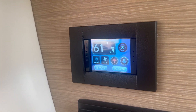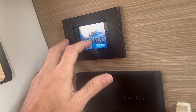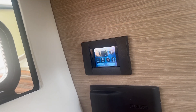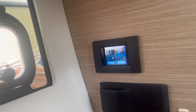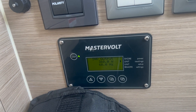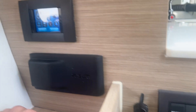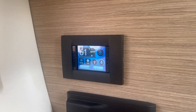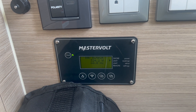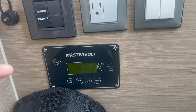Set for 50 degrees, it's 62 degrees in here. Going back to auto speed and bringing the set temperature up to where I want to be — I'm going to say 61 degrees in the boat. It's already 61 in here so I'm looking to maintain 61. It takes a little time for the compressor logic to start controlling everything, but we're already down to 360 watts. In auto mode with the set temperature matching the return temperature, the unit is just maintaining. Note that this wattage reading also includes the circulation pump, so this is the unit and the circulation pump together.